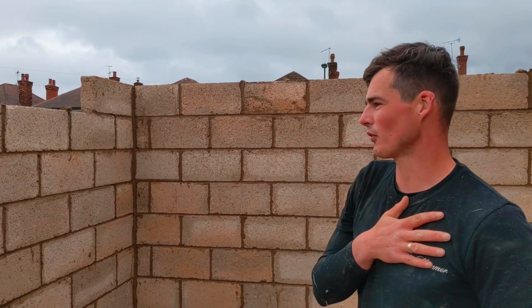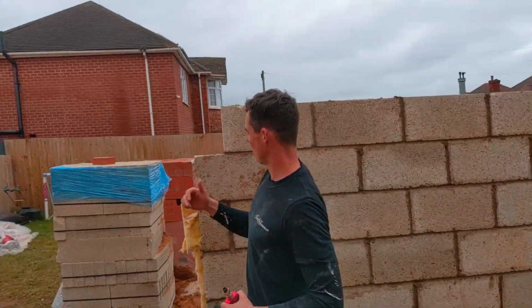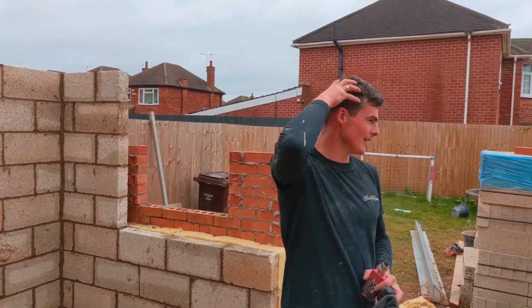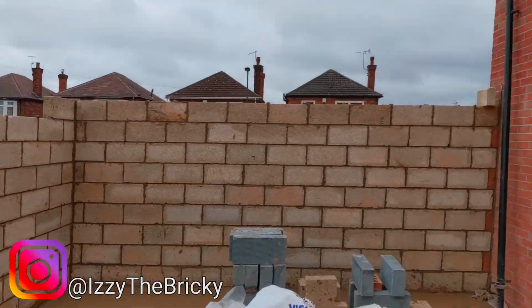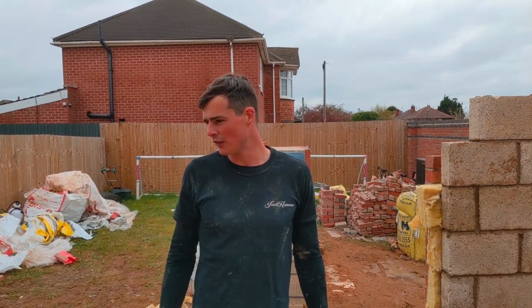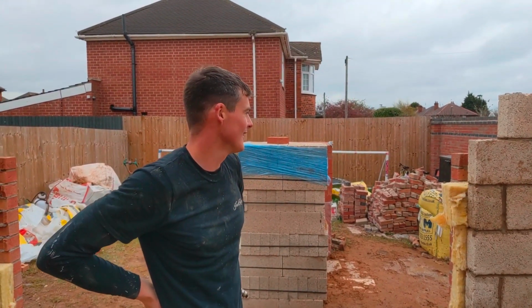Yes, so we are pretty much done for the day. We have got 9 courses all around the job, apart from that little bit there, which needs one more course. And this here is going to wait and see what we actually need. Overall, I think we've got about 9, 18, 27, probably 320 something blocks down. No records broken, but concrete blocks on a wet day, not too bad. All the walls are pretty plumb, so that's what we like.